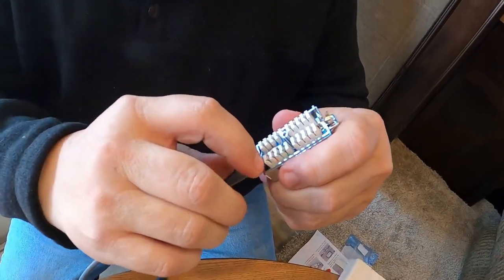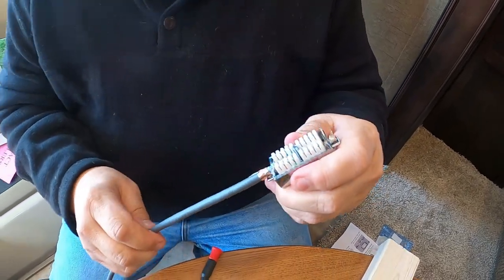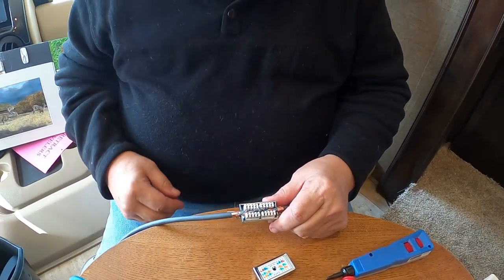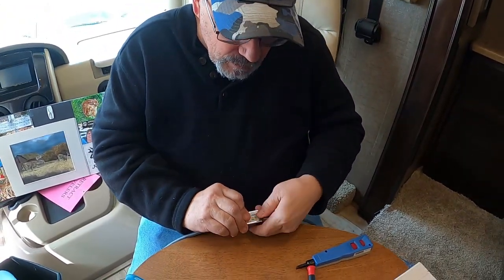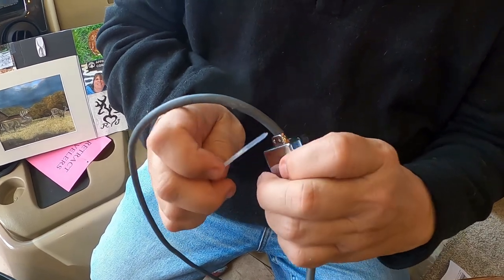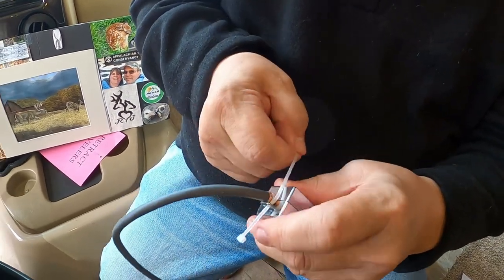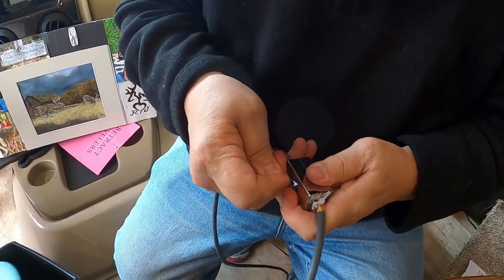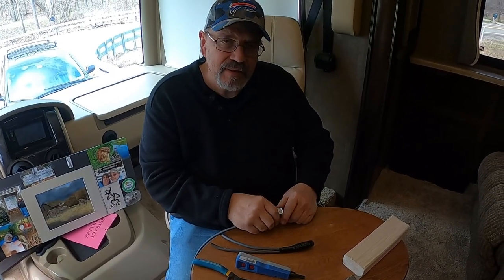You can see each individual wire has been pushed down and snipped off at the back end. Now I'll go ahead and do the other cable. Now we have both cables pushed down into our coupler box. Take the coupler box, put it back on top, put the screw in and tighten it up. They give you little zip ties - on the bottom you can see holes, you slip the zip tie through one hole, back around through the other, and that helps keep the wires from being pulled out of the coupler box.